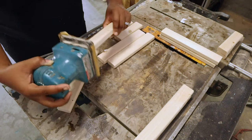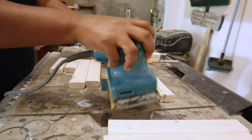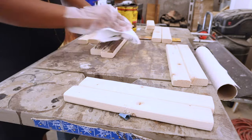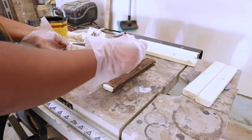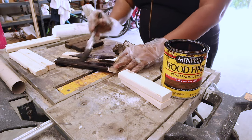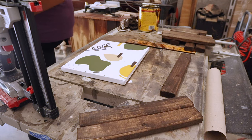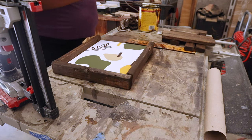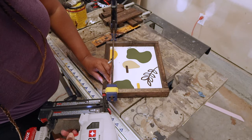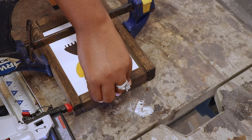After I've made all my cuts, it's time to sand smooth my pieces — the tops, the sides — and round them out a little bit so they fit together nicely. After sanding, the next step is staining. The stain I'm going to use is Dark Walnut, and I am going to be staining all of my frames that color, then let them dry. You can seal these with a polyurethane or a polycrylic. After my wood has dried, I'm going to attach all my pieces together using my portable nail gun. If you don't have a nail gun, you can use wood screws or regular wood glue to attach these around your canvas.